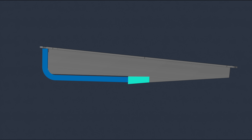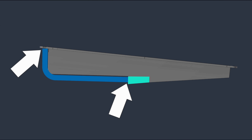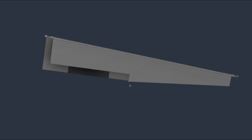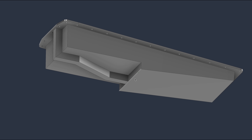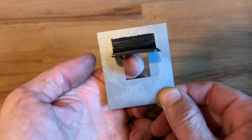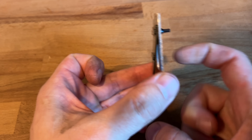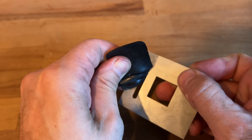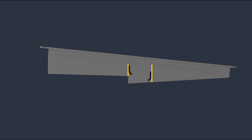I had originally thought about doing this with a round tube bent with a tubing bender, but I didn't do this. For one, it would have a big radius, which means I'd need to radius the pan here with a bend, and I don't want to do that. Also, it seems kind of flimsy to just have a tube attached at two points while otherwise hanging out at the lowest part of the engine. So I decided to get some square tube — I can get a slightly heavier wall and tack-weld it along the seam, making it pretty strong overall. Now, some of you are thinking that as soon as I press the accelerator, the oil is going to slosh back, and as soon as I press the brakes, it's going to slosh forward. But no, because I am using little flappy rubber doors. They're flappy, so oil can go one way but not the other, and they're really easy to install — you just need a slot and a hole. So I made two walls, one in front of the pickup and one behind, both with three little flappy rubber doors.